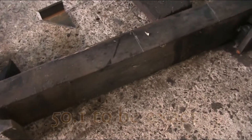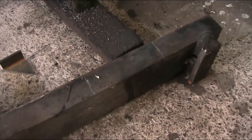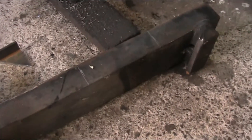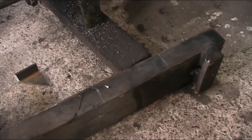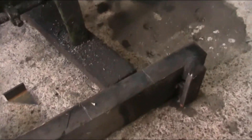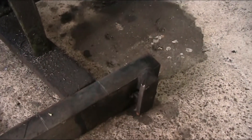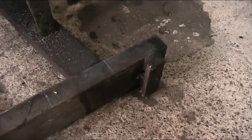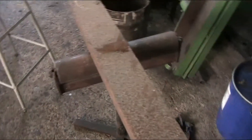This piece is a little bit over 50 millimeters thick and I need 50.8 in order to get 2 inches, so I'm going to have to put some material onto it. Probably some 6013 — 7018 is a little too hard to work. So probably go with a 6013 and just put another millimeter or two on there so we can plane that down and get a good surface on there that's hardenable. And then of course these L brackets here have to come off still. The rest of the fork is going to make all kinds of other good stuff.